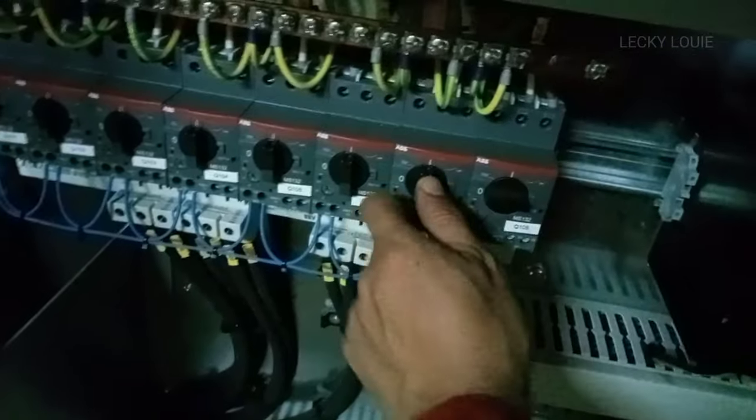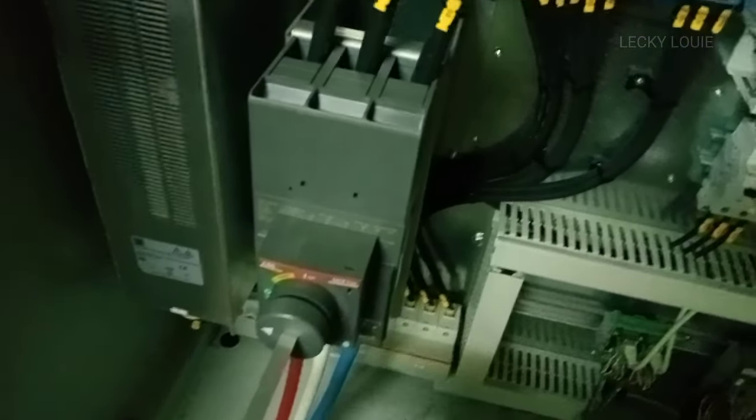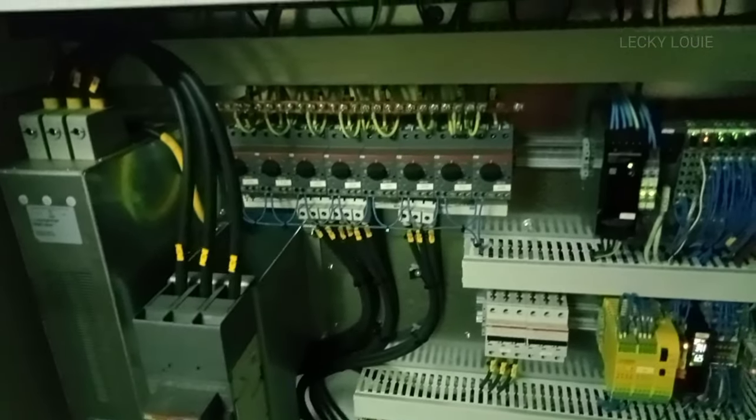This is the electrical cabinet whose power supply is from BWT1 LDC2. From here, we need to switch off the supply breakers one by one to check which load exactly the low insulation alarm is coming from. With the help of my chief engineer, he will monitor the low insulation panel in the main switchboard, and I will energize the supply breakers one by one.